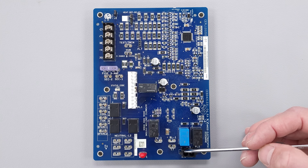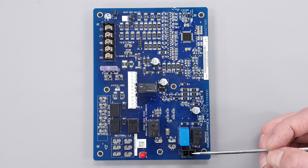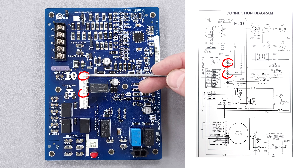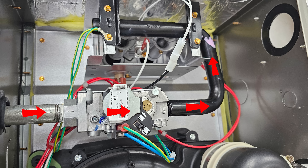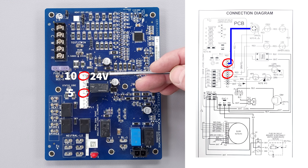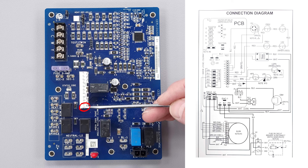After the inducer motor is powered with 120 volts and the pressure switches are closed, the hot surface igniter sends power to the HSI and it turns cherry red. Then pins 10 and 5 are going to be supplying 24-volt power over to the gas valve in order to electrically energize that gas valve and allow either natural gas or propane to flow through to the main burners. Pin 10 is your 24-volt power and pin 5 is going to be the ground and also the common wire for the gas valve. After that happens, your flame rod is always going to be applied with right around 100 volts - it could be like 80 to 120 volts.